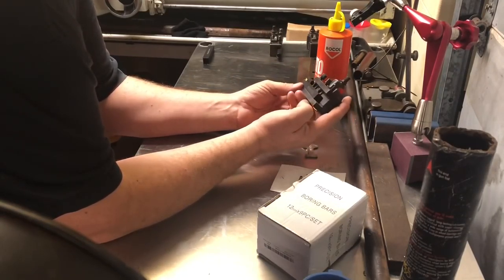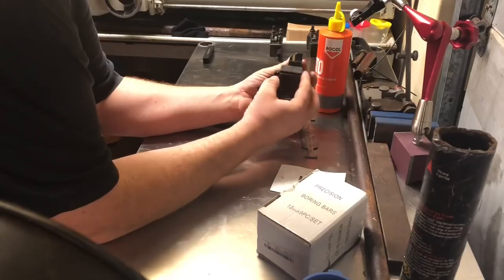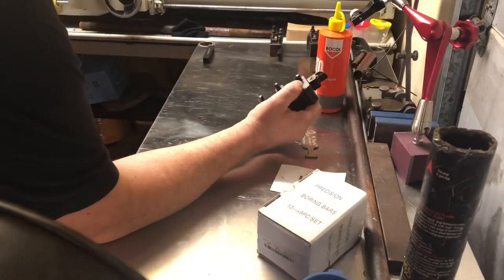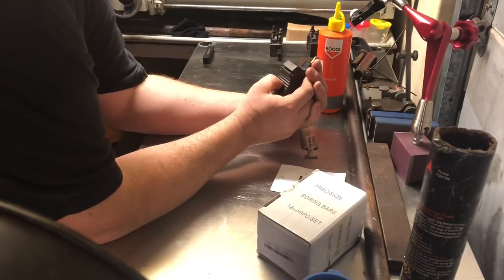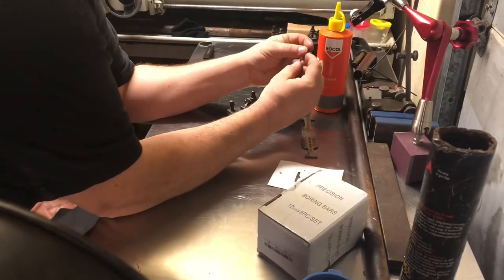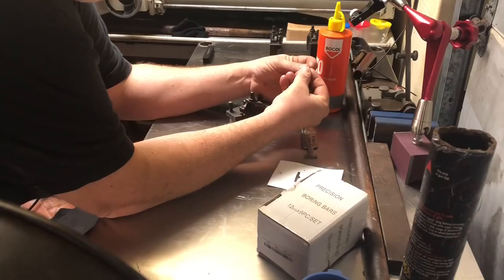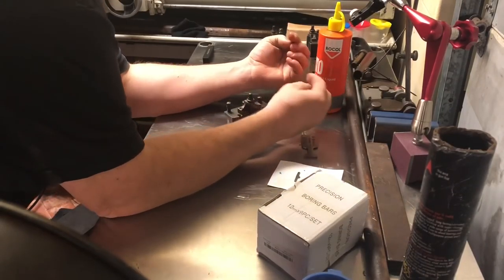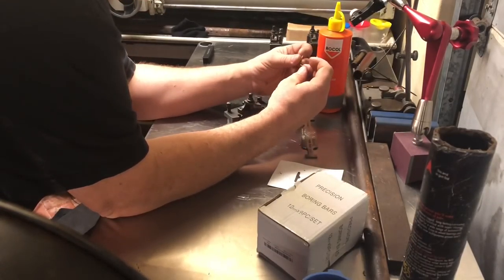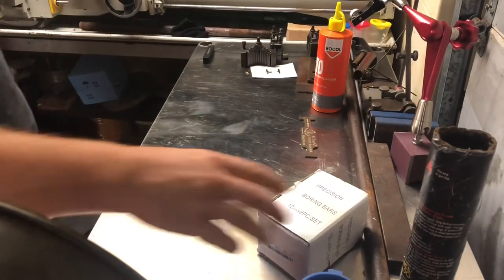So I think I terminally damaged this 12-12 insert cutting tool. No great loss, other than it leaves me without a parting off tool. But yeah, I have a lot to learn there. I was managing to booger up one end, snapping the end off, which meant I couldn't use the other end because the way the insert holder works, it needs the back to hold it in place. So I was going through inserts at a rate of knots. So that was another thing that happened.